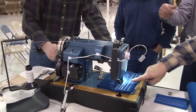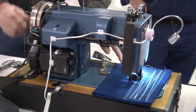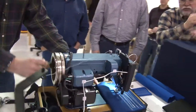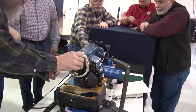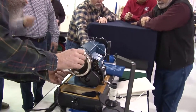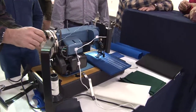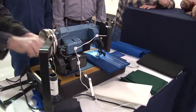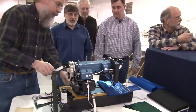You just use the reverse lever. This upper foot grabs the material and there's also a dog on the bottom that's grabbing the component through with a constant pinch — a more positive feed. The typical home machine is just the dog on the bottom. You just pull this down and now you're in reverse. And if you've got slippery material like spinnaker material, it doesn't work back on the side — the friction is not as much.